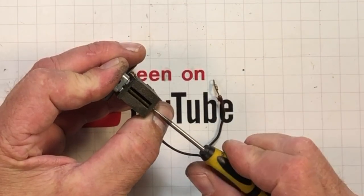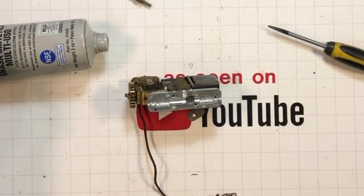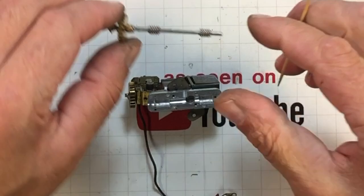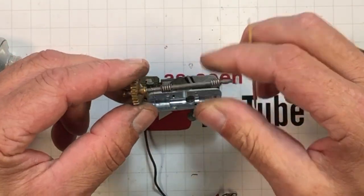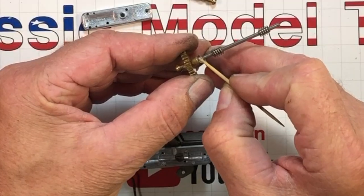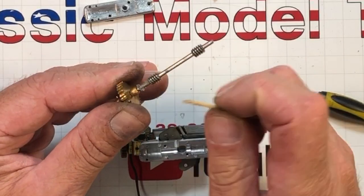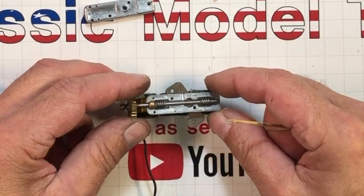Get our magnet bolt in. This is starting to come together — pivot still pivots. Back to our multi-purpose synthetic grease. This has got thrust washers — there are two of them right there, just like they're supposed to be. I couldn't be happier, so we're going to make sure they are lubricated. The shaft underneath this bushing needs to be lubricated too. This sits in there like that, and we've got one for the back side also.